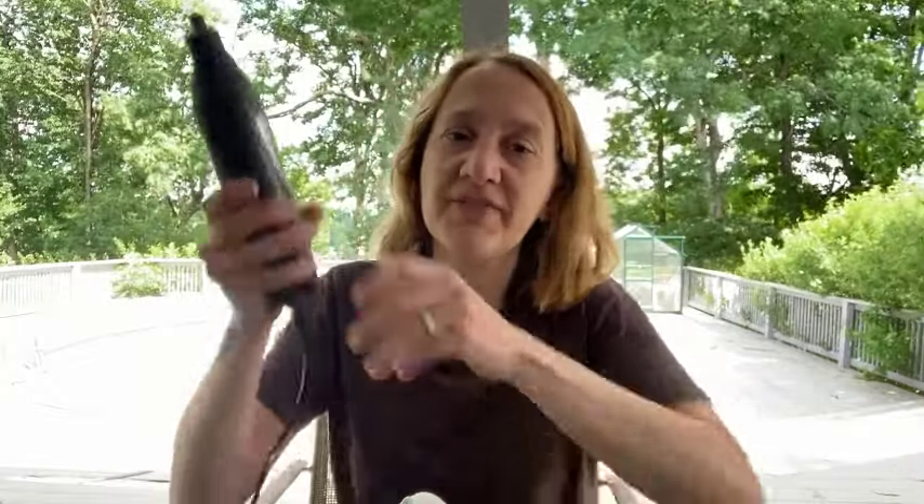One last safety concern: this is a very powerful tool. If it's strong enough to cut porcelain, it can cut your finger too, so be very, very careful as you work. As you're using this, you should not need to apply heavy pressure. If you find that you have sparks or overheating, or you have to apply pressure to make your cuts, you're doing it wrong. Nice and slow and easy. If you're getting overheating or sparks or it's not cutting, don't press harder — instead, double check and make sure you're using the right accessories for the job.